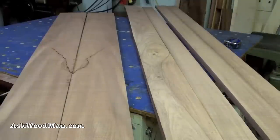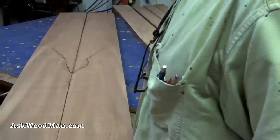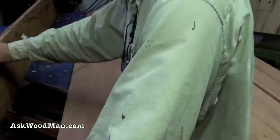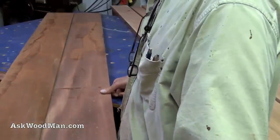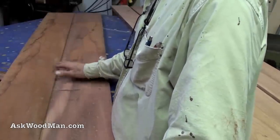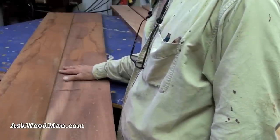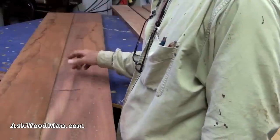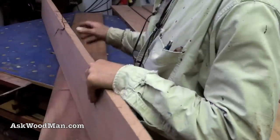This is going to test my repair skills. I love this mahogany look — it's just beautiful — but this side has too much damage. I think the bookmatch other side will work for me; it's not as bad. This will be the front and that'll be the back where my arc gets cut. I'm probably going to the hardware store to buy mahogany-colored oil-based putty and mix that with five-minute epoxy to make all my repairs, then sand it flat.